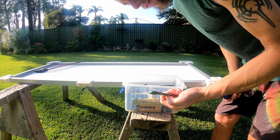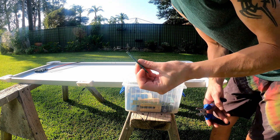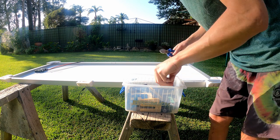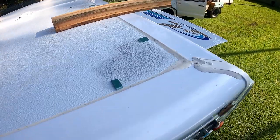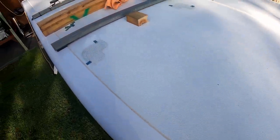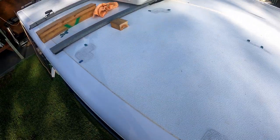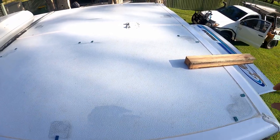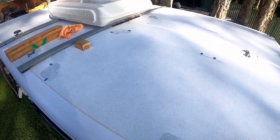Another thing you'll want to do is get some packers ready for each of the mounts in the corners. They recommend three to four millimeters — I'm using these 3.2 millimeter window packers, just cutting a few pieces up so the adhesive stays at the right thickness when we put it on. I've put my little packers on the edges of where the mounts are going to go, and I've also put a couple of thicker timbers on either end so I can put the panel on top, get it aligned perfectly, and then pull the timber out whilst dropping the panel onto its perfect spot.